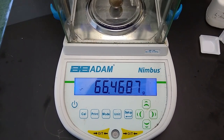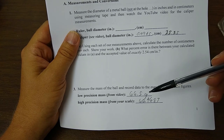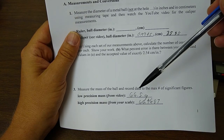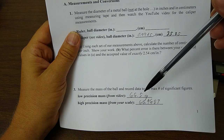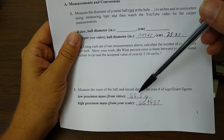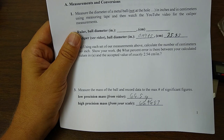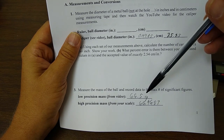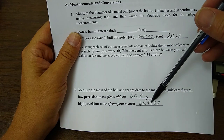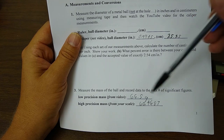Here is the middle ball of unknown type — putting it in and closing the cover to protect from air currents. We wait for the little squiggly line indicating the reading has stabilized. Write that down — that's the super precise mass of the metal ball. Now, do these two mass measurements agree? Well, 66.5 on the low-precision scale means 66.5 ± 0.1. The analytical scale reads 66.46, and if you round that it gives 66.5 — so they agree perfectly within their precision levels.